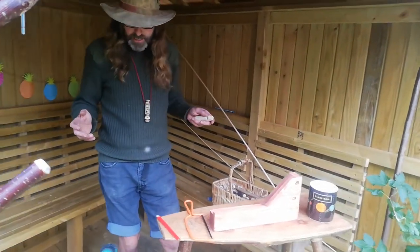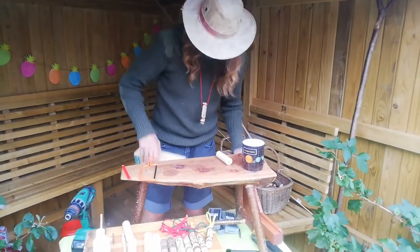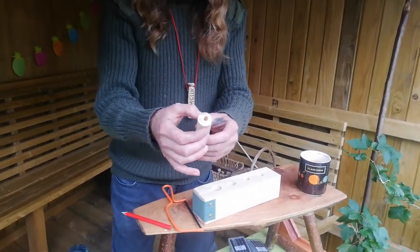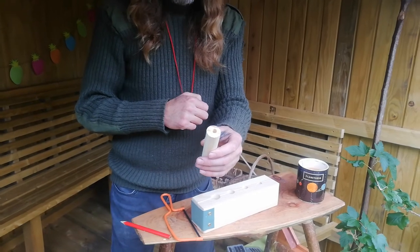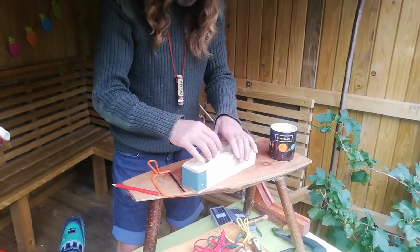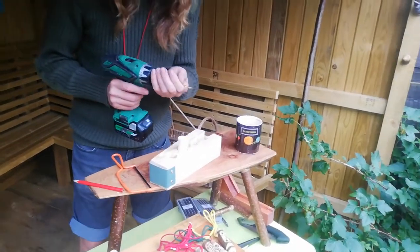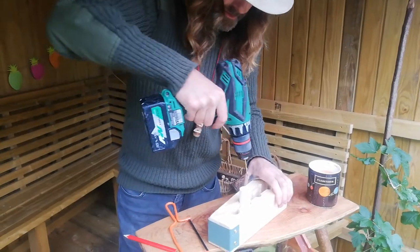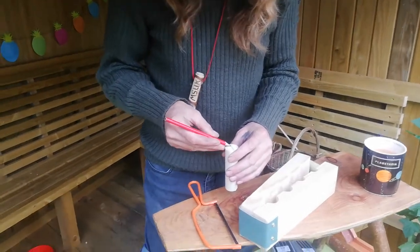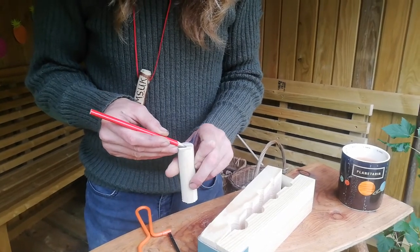I think we're pretty much ready. I need jig number one. You'll notice the blanks we're providing come pre-drilled. I've already drilled them. If you start with an undrilled blank, you start off with a 4mm drill bit and you go through there — first you try and find yourself a centre, just sighting it up. Trust your eyes, trust your judgement.